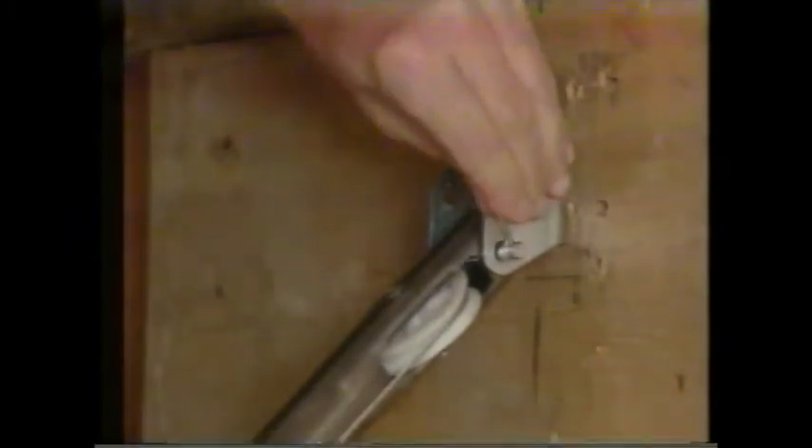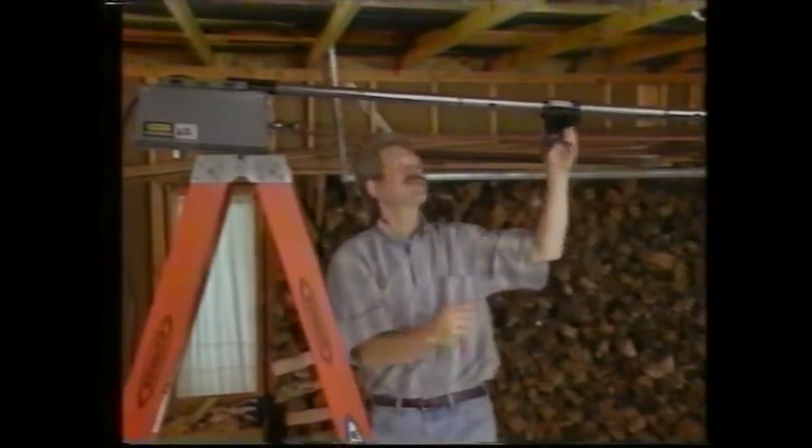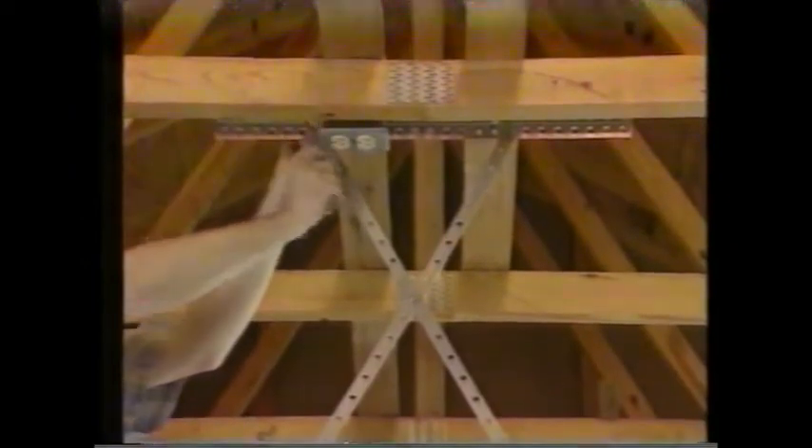Raise the boom and fasten the end of the bracket with a pin and lock clip. To attach the power unit to the ceiling, place it on the ladder so it's high enough to clear the door. Then pull the emergency release cord and draw the traveler assembly toward the power unit. Center the opener over the door and support it on a 2x4 to ensure adequate clearance between the opener and the door. Attach the angle iron to the ceiling above the power unit, then use the metal straps included with the opener to hang the unit from the angle iron. This mounting may vary according to your ceiling design, so check the instructions for specific examples.